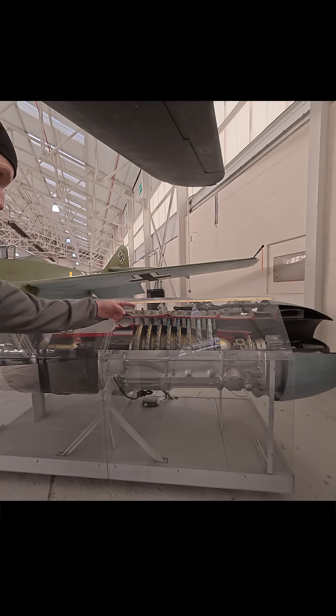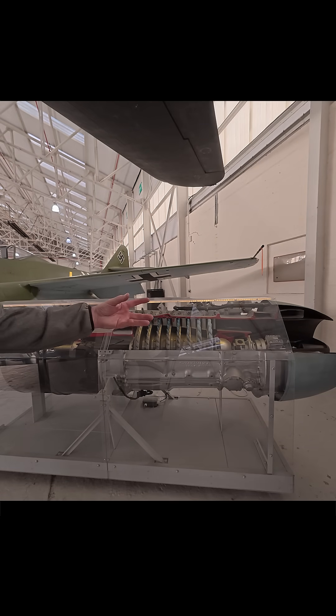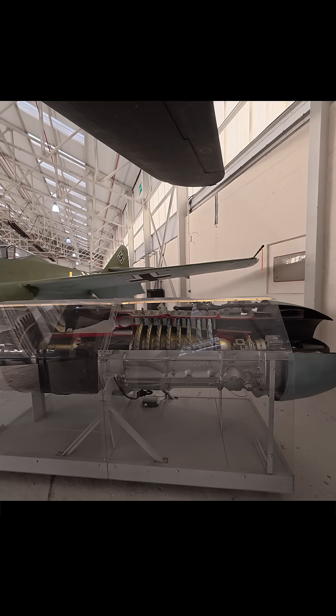On a regular turbine, you have turbine blades and they're used to pull air into the engine, which is then combusted and blasted out the back. It pushes the turbine blade at the back, which then drives the compressor blades at the front. And so you can start these up with an electric motor — you spin up the motor on the ground, start air going through it, and then start the combustion cycle of the engine.